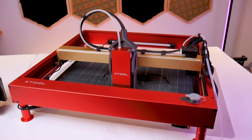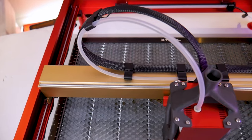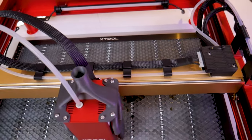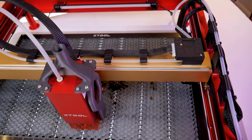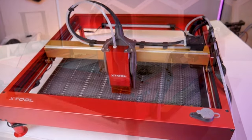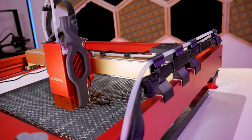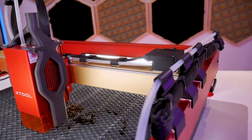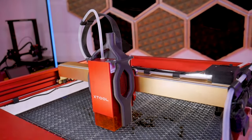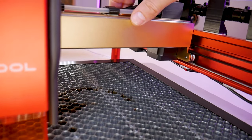Good quality cable chains can be quite expensive, plus they're a little bit overkill for this application. Cable chains are intended to be used a certain way, and if you're not using them correctly it can actually lead to more abrasion. Furthermore, the cables and hoses that go inside cable chains are supposed to be rated for that application because they're going to be constantly rubbing the inside of the chain. Those specialty cables and hoses can be quite costly, and none of the kits I've seen online are using properly rated cables or hoses anyway. My solution is a good balance between cost, complexity, and the function it needs to serve.